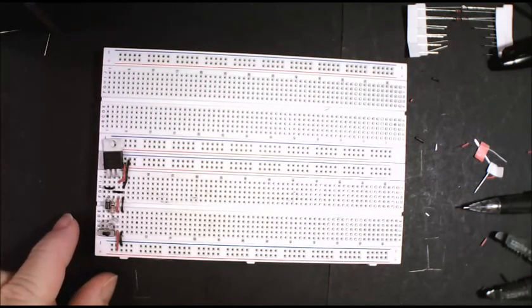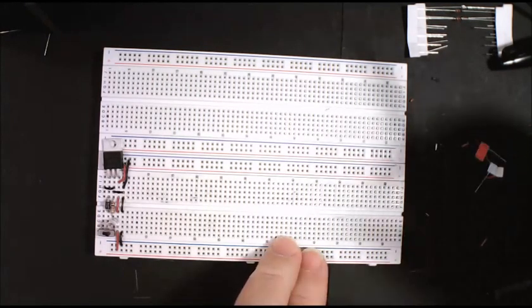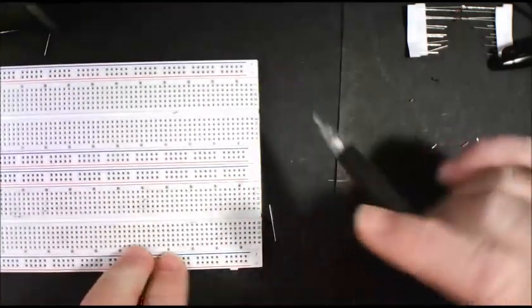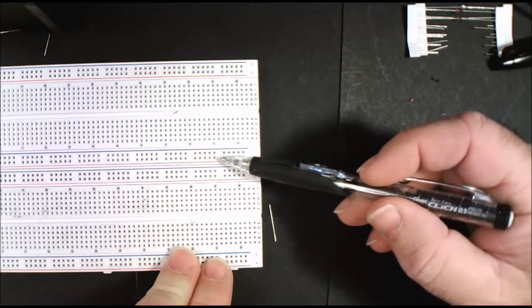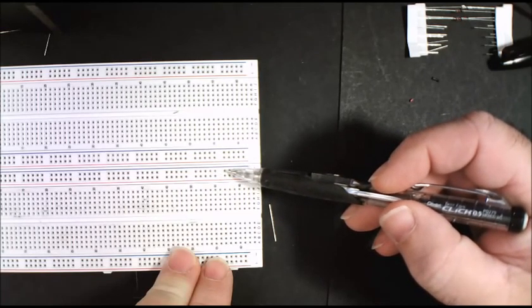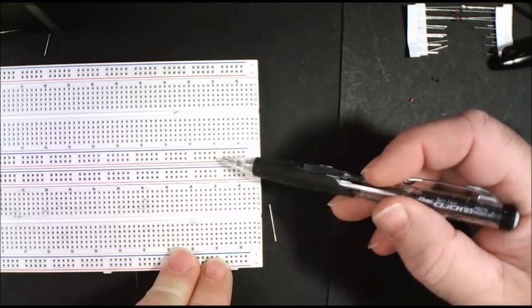Now I'm going to take a look at my old board. We are going to put a red jumper at position 55, going from red 2 to red 3. And then on the other side is ground — from here to here. So we are going to do the minus and the plus from here to here. These turn out to be 9-hole jumpers — I can just cut two nines. Stripping 3/8 of an inch long, which would be 3 holes.